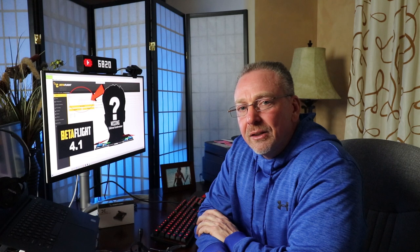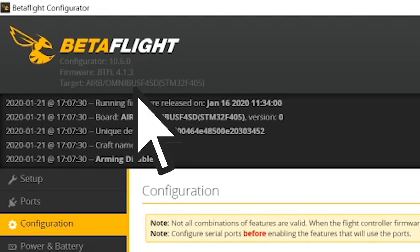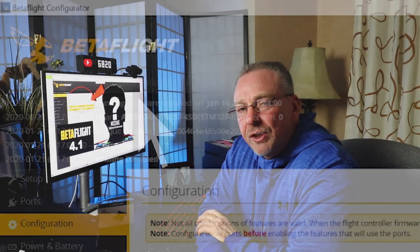Again, Joshua Bardwell does a great job with his whole playlist of videos on Betaflight. The problem was trying to pull all the information together and make sense of it all as I'm new to the FPV hobby. I also noticed that you'll see the proper target file in Betaflight Configurator in the upper left-hand corner as well — the firmware version there seems to match what you'll see in the diff all command of the CLI. So this would be another sanity check to ensure you're downloading the right firmware. Just take a screenshot of this and save it for future reference.